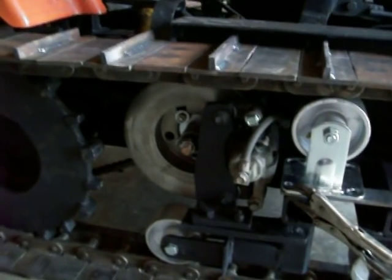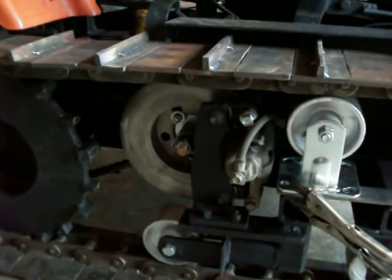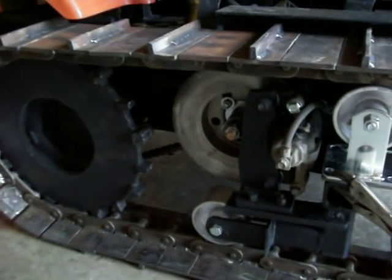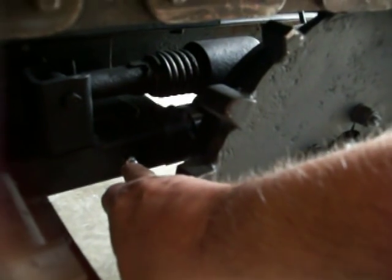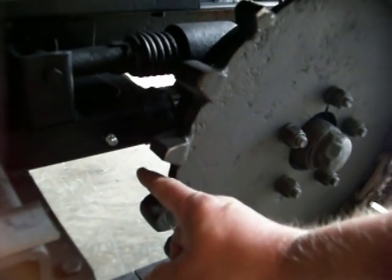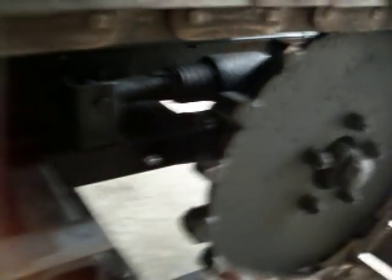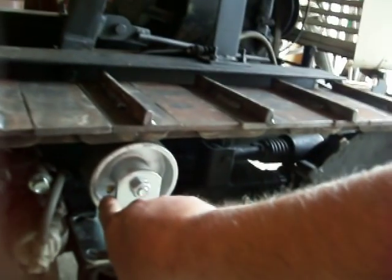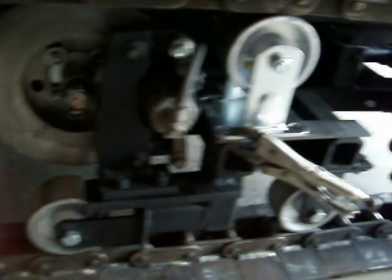Shouldn't take long, but even as excited as I am, I'm still not in any big hurry to get out in the yard. Just go one little bit at a time. Also, I put some new 45-degree angle grease fittings here because it was hard to get a grease fitting in there with the tractor mounting pull back. Put an angle fitting right there and one in the back, so it'll always be easy to grease these bogey wheels. See the little grease fitting right there? I've got them turned to where you can easily get to them.